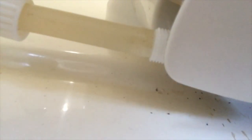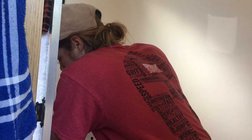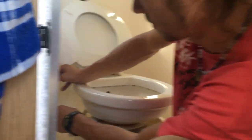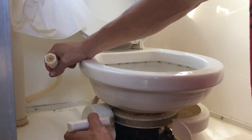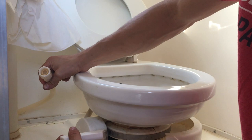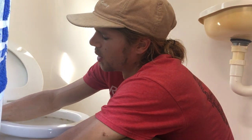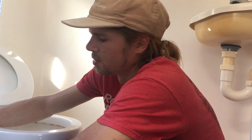I am starting the toilet removal by taking off this water connection. We just removed the water hose. We don't have a cap for it, so for now we're just going to tape it. Tape is just a temporary fix, but it needs to be plugged up because it is hooked up to the water tank — it's a water line, so anytime you put on the water pump it would send pressure over here.